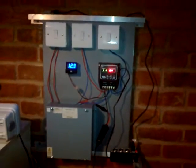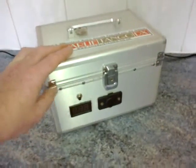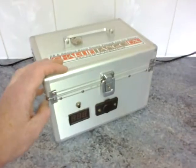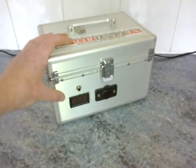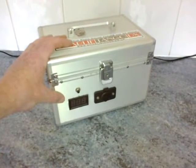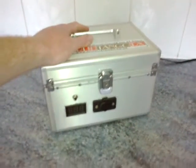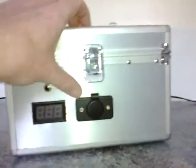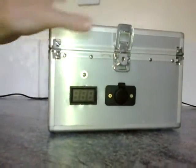Now in the house - this is the smaller portable unit. I started off with a 4 amp 12 volt battery but it was a bit heavy, then put in a double-A battery pack, but wasn't happy it would last for what I wanted. It just needs to run a radio portable, or for wild camping to charge phones, tablets, and run lights - basically an emergency lighting kit with other uses. It's got a 12 volt socket on the front, a voltage meter with a push button, and mainly charges off the small solar panel, though you can plug in a mains trickle charger. It's also got a couple of little USB torches.